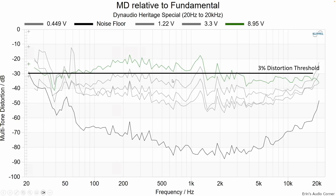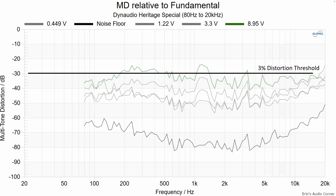Multitone distortion, however, shows a different story — it's relatively high. My personal line is 3%, and I have a whole video on that. When I see it go above 3%, that raises flags. But I'd be lying if I said I heard this right away, because I didn't. Maybe I was keying in on other things, or maybe the output on the low end was keeping up so well and there were no mechanical noises that my brain filtered out any distortion. If you use a subwoofer and cross over at 80 hertz, you do decrease the mid-range distortion quite a bit — though the 1.2 kHz distortion, which I associate with a compliance issue, remains.